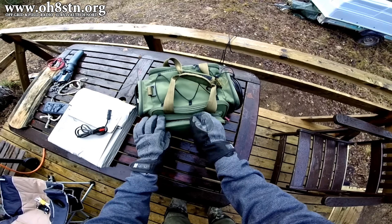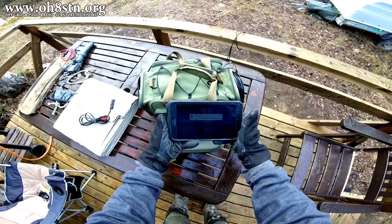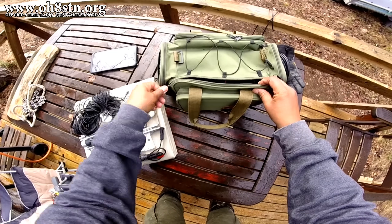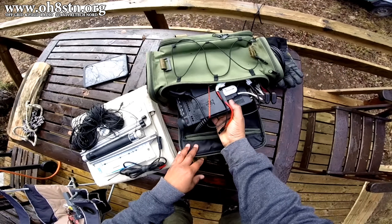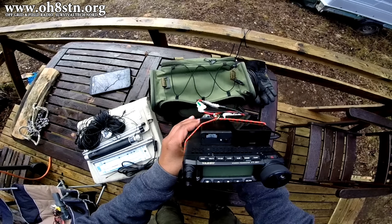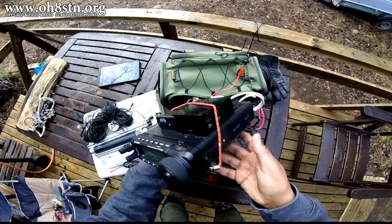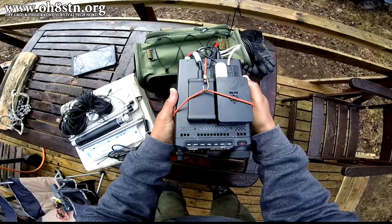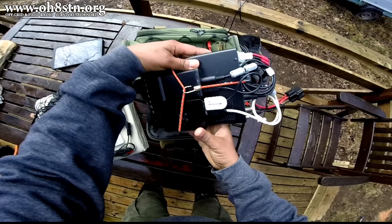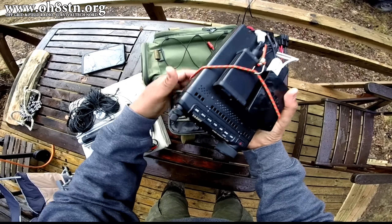Let's move on to the rest of my ham radio go kit. I'm always using this rugged Android tablet. I can use it standalone or connect to the Raspberry Pi to control my radio. Next out of my kit is my HF radio — this time I'm using the Yaesu FT-891. I use the FT-891 and a Raspberry Pi 3B Plus as an integrated radio system; from an operational perspective they are one and the same. Audio handling and PTT is handled by the ZLP Mini Pro SC. I use a GPS connected to my Raspberry Pi to keep the clock synced and up-to-date. Many of you have suggested using WWV for this purpose, but I can't always hear it and I'm not going to rely on that.